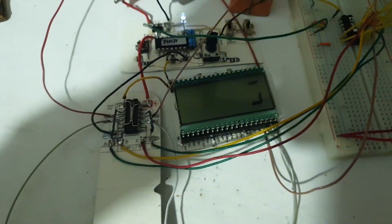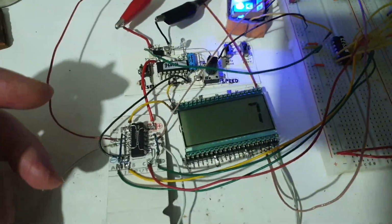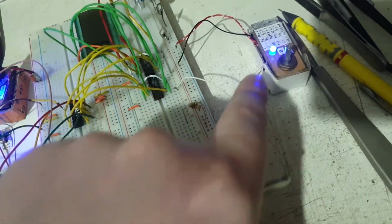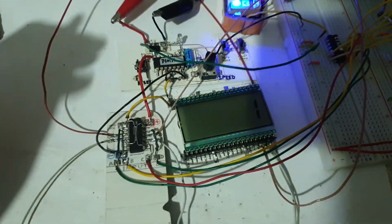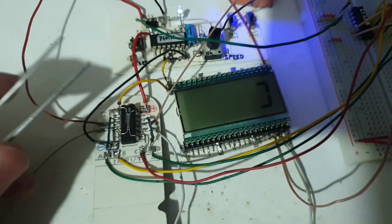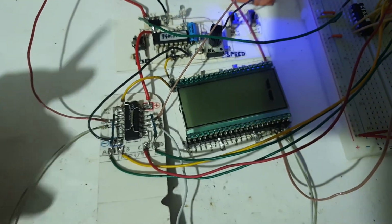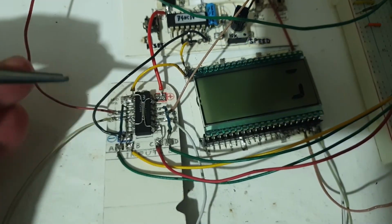And then I also made a lot of tests. I dragged the signal from there, but absolutely no problem. I mean, it was the same thing, the same errors I was getting. The signal from this 100 hertz generator that I have here for this driver chip, I took the signal from that and put it here with a very long wire, but that didn't solve anything. But I was thinking maybe that's the problem. And many other permutations I did, until I started to realize maybe it's the chip, maybe it's burned, maybe I used it so much and put the soldering iron on its pins, and probably one gate or one input or one output got damaged.